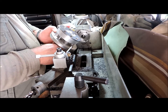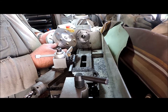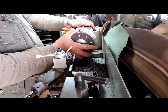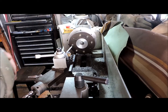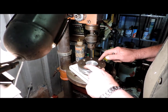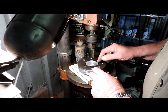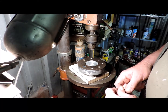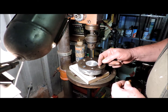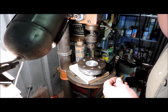Now they're going to be an issue. They have to be countersunk. Countersunk bolts. All right. Leave that for me to sort out. I'm just counter boring all four holes here, so I've got clearance when I mount it onto the lathe spindle, because I had to make sure that the flats were pointing to the spindle so I could get the thing over the flange.